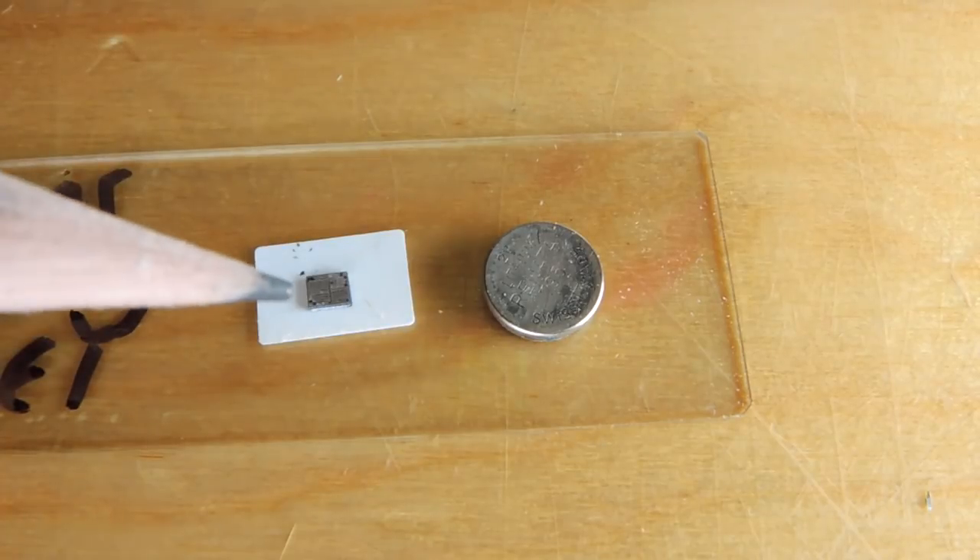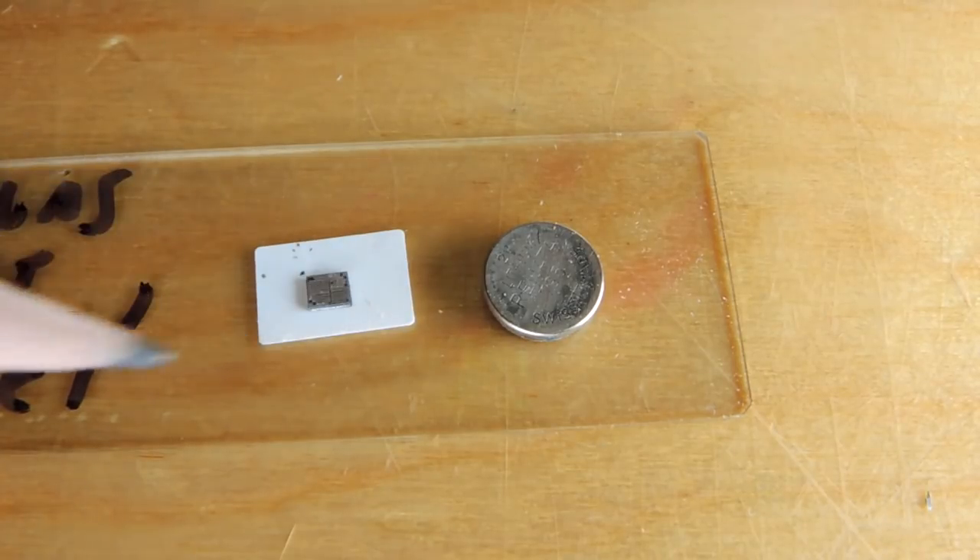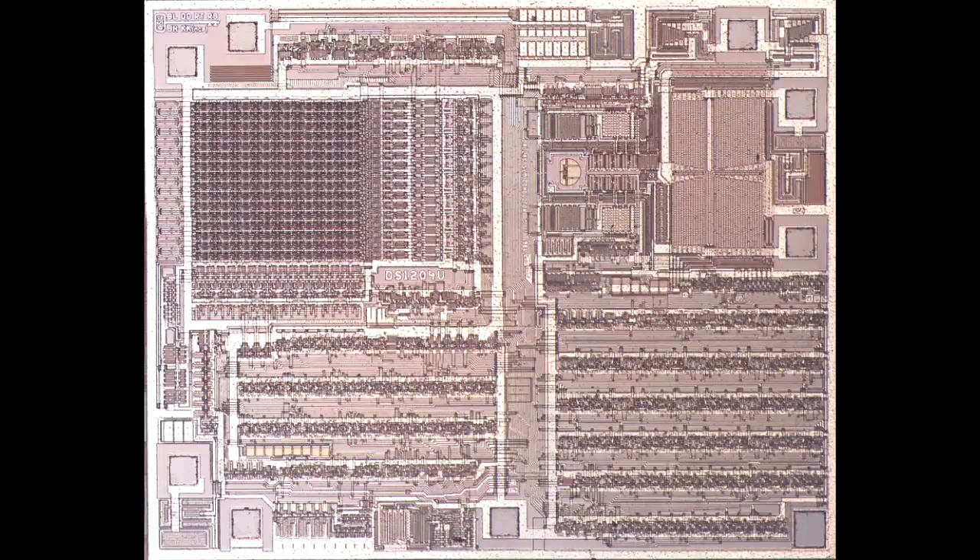Let's take a look at the actual integrated circuit and see what we can see. Here's the whole silicon die — there are four major areas. The first and most obvious is the regular array pattern. If you count the columns you get 16, and if you count the rows you get 16, which of course is 256 when multiplied together. That matches the 256 bits of data this chip stores: 128 bits reserved for the key and 128 bits reserved for user programming.